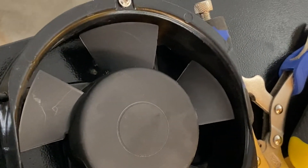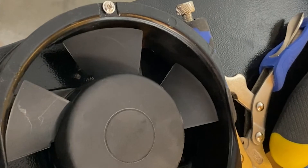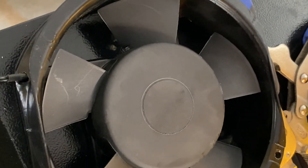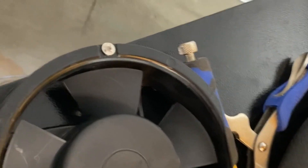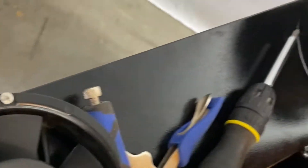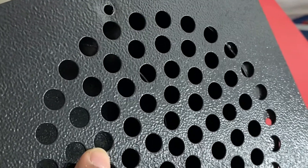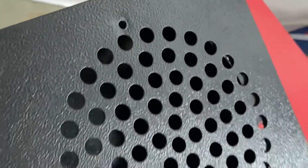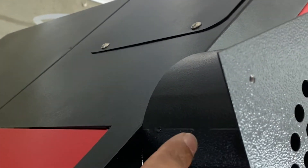We have the stock fan disconnected from the face plate and the collar. I went ahead and put the screws back in just so I have them if I ever decide to put it all back together. What we're going to do now is take this plate, mount it so that it lines up with the holes here, put these two together, and mount it back inside your laser. Now you have a collar to attach your exhaust tube to your upgraded exhaust system.